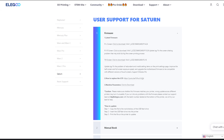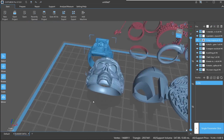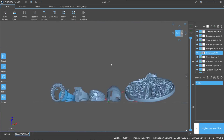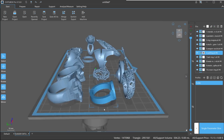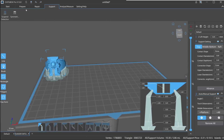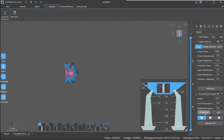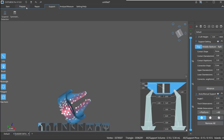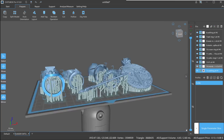One quick warning about the pro version: you need to upgrade your machine's firmware before you can use the files from it, and you can get the upgraded firmware from the Elegoo website. This is not a for-everyone type of program — it's literally a pro version with settings and advanced settings that normal people wouldn't be dealing with, but you have the ability to customize just about everything. The free version will be free for life and updated alongside the pro version. One thing I'm excited to start using is the multi-parameter function, where you can tell it to print at a certain layer height and then change it at different points during your print to get finer detail on the tops of rings, and print faster in the middle sections — so instead of taking 20 hours, you can cut your print time way down.